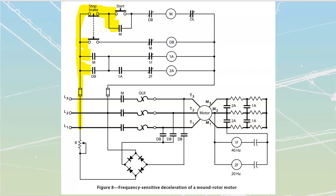over here, which shows that we have got power now just sitting and waiting. And we're also going to carry power through to here, as well as take power off of here, which once again is going to be passing a positive through there. So this is going to become my positive rung. This is going to become my negative rung, but they're all isolated off of the fact that we've got that dynamic braking contactor sitting on them.